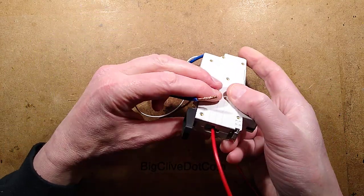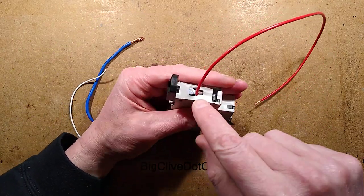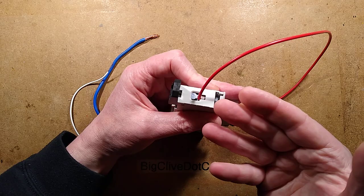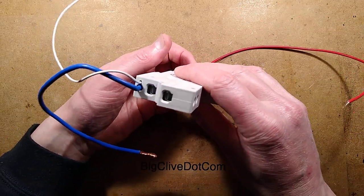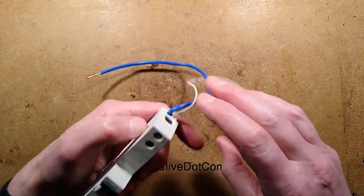Worth mentioning, and this is nice, it's one of the few manufacturers that seem to do this, that MK have actually put the little flag here, that when you tighten up, the little flag comes up, which means that it's much harder to actually sit this over a bus bar in a distribution board on the wrong side of the clamp, which is a common problem.